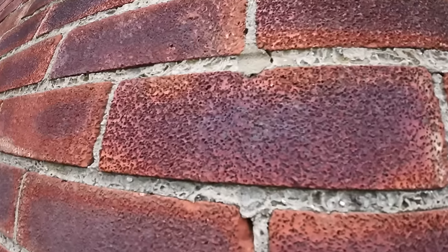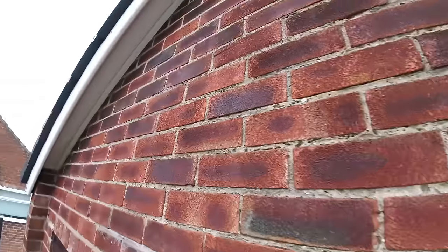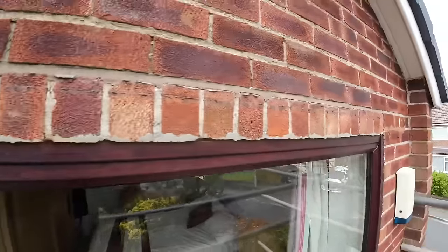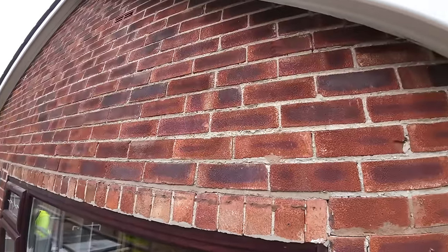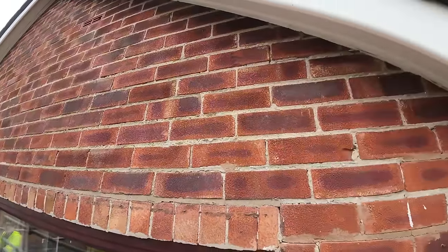There's one. The telltale patches. There's another one. So we're going to have 100mm strips of insulation, please, mate. The usual gubbins to stop the cavity evacuating. Not that you need to insulate the apex pike gables on houses, because you're just insulating the loft space.